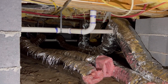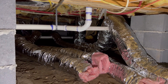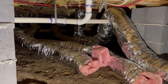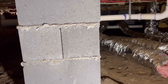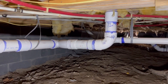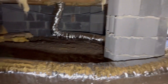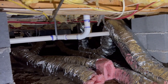It's a three-ton system, so two 12-inch trunks is right about where we'd be. Sometimes you oversize to get a lower static, but I find if you stick to the two 12s for a three-ton — especially if most of the trunk side is hard pipe, which some of it will be — we should be pretty good. So we're looking at 12-inch on both sides. We're going to need a couple more boxes of 12-inch flex, which will be hard to find. There's also a dryer vent down there that'll have to be completed in advance, and some bath fans around here somewhere. But that is a viable solution that might get us a good system and not be too difficult as a one-man show installing it.